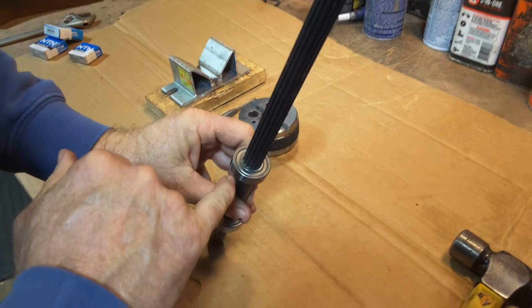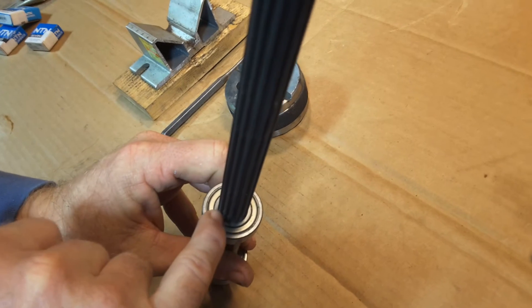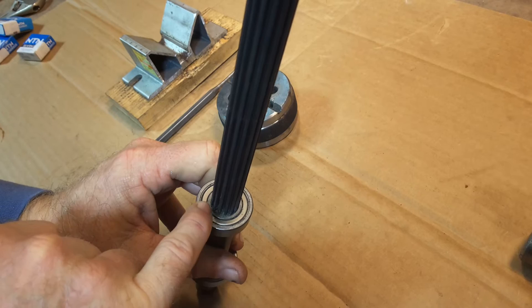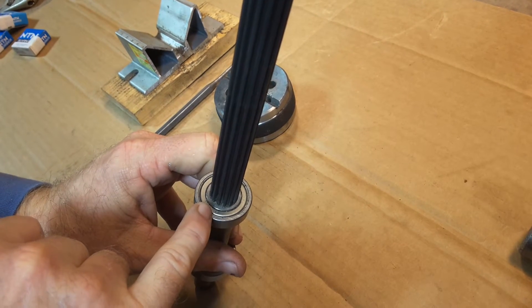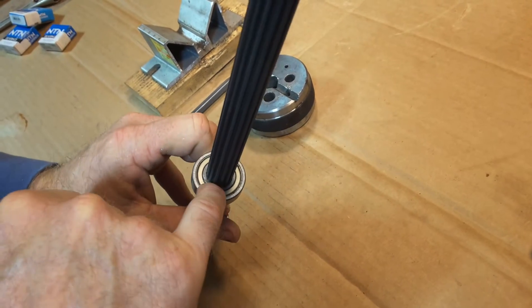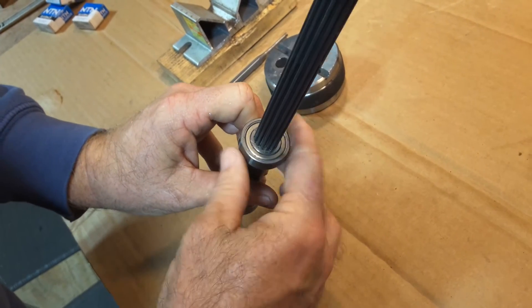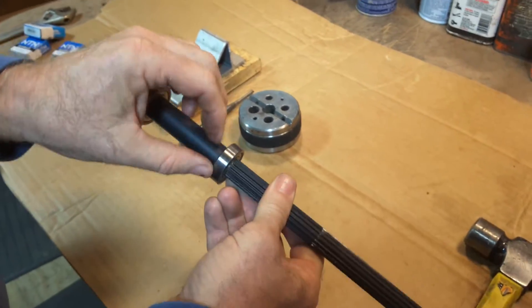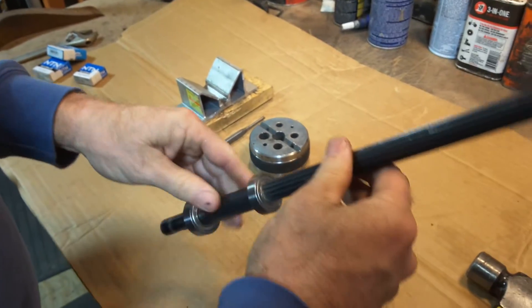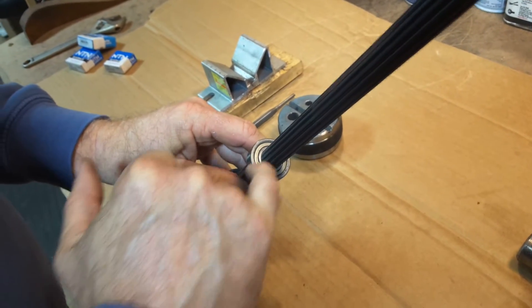You can also look carefully back here. These little splines overlap the bearing, so that's also a clue that you have to remove this. Because those first ones don't have the roll pin — if you see the splines overlapping the body of the bearing itself, you know that you have one of those early ones. But the newer one-part shafts have bigger bearings, so the splines don't overlap the bearing.